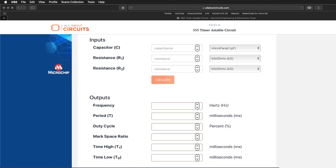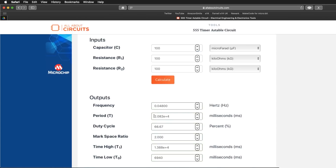There are a bunch of 555 timer circuit calculators available online. I like to use the one at allaboutcircuits.com — that's also where I got the formulas I've been using. If I input 100 kiloohm for R1 and the same for the thermistor value for R2, and make the capacitor value 100 microfarads — okay, that's way too many milliseconds, way too long. Let's try 10 microfarads. It'll be on for about 1.4 seconds — that's probably longer than I want, but getting in the ballpark. Let's switch over to the breadboard so we can see it with real parts.